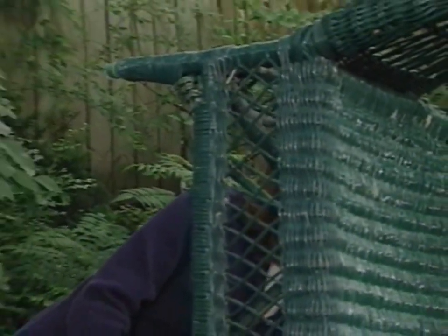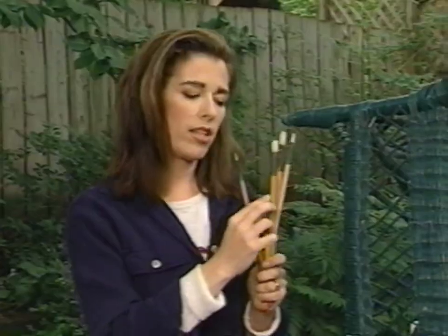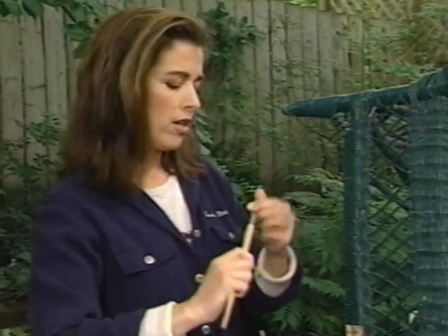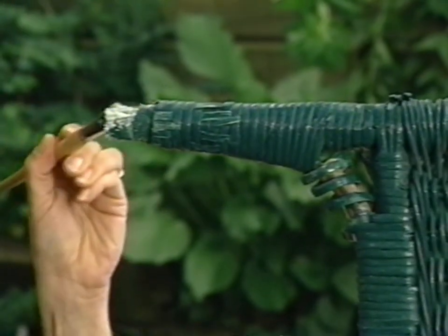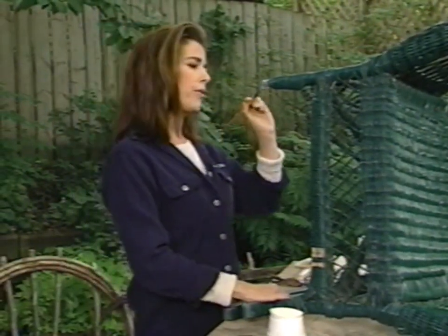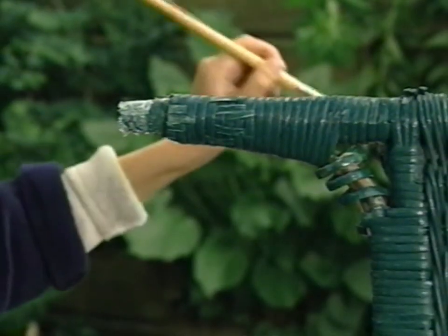I store an arsenal of paint brushes of various different sizes, and that's because when you're repairing stuff you're always improvising, so it's good to have lots of different sizes. I'm picking a stiffer bristled brush and I'm going to dip it in the glue and cover both the leg and the inside hole on the rocker with a thin coating of this carpenter's glue. I have to do both ends because I've got to work on both ends of this rocker.